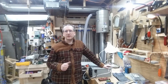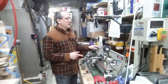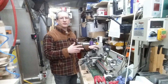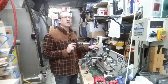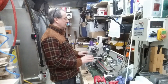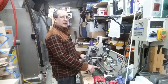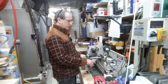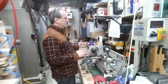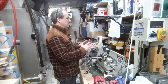Let's head over to the metal lathe and I'll show you what I've gotten to. This is my metal lathe, the Grizzly G0768Z. I showed it off in the shop tour video — I can put a link to that if you want to watch it. An important part of it is what's called the lead screw, which is this piece right here that runs the length of the bed. As the motor turns, gears in the head end turn the lead screw in some ratio to the rotation of the spindle.